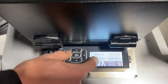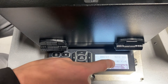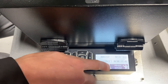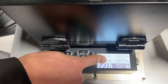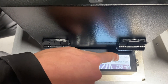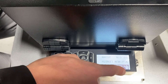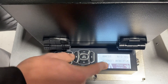Maximum length — this is the length of the label that travels through the printer. You can always have the length here higher, but you should never have it lower. If you have it higher, it won't really affect the performance — it'll still stop at the gap. If you have it too low, and let's say we're running a five inch long label but we have the maximum length set at four inches, the label will travel four inches and stop until you don't have any labels left.